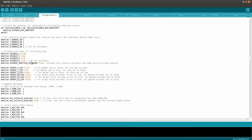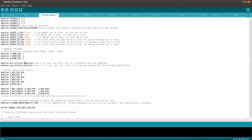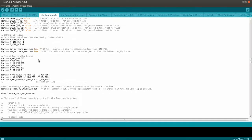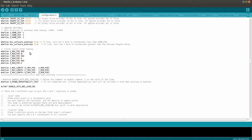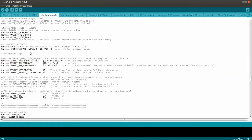I set the stepper motors to be disabled when not in use — better doing so, as I found my stepper motors were getting too hot with that set to false. Here you can set the axis direction if they are going the wrong way. You can also set the homing end stops to be either on the max or min limit switch side. The maximum axis position can be set here. Finally, the acceleration, feed rate speed, and steps per unit — this is very important and took me some time to figure out. The values will depend on the gearing ratio and the type of stepper motors you are using. It's better to start with small acceleration and feed rate values, then adjust on the fly using G-code commands that Marlin provides.